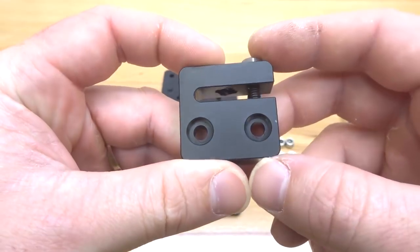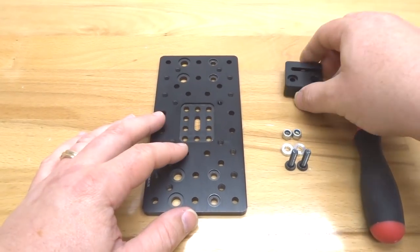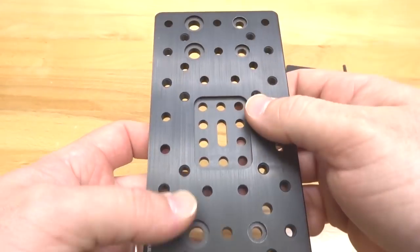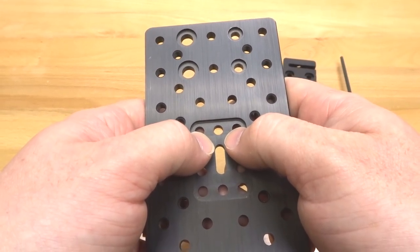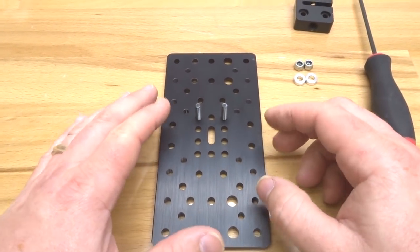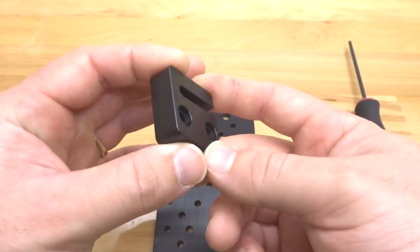This is to prevent any backlash in your system. Feed that grub screw in, just kiss the back of your anti-backlash nut block, and thread on that hex nut. Taking notice of our double wide gantry plate — we have eccentric holes here which are slightly larger than our fixed wheel holes. These holes have to align correctly. Our anti-backlash nut block is going to be placed into the two top holes, so feed your M5 screws through those holes, rotate the plate around, and add your 3mm aluminum spacers to each screw.